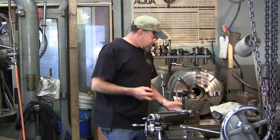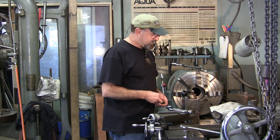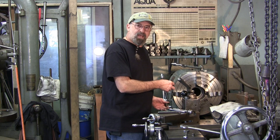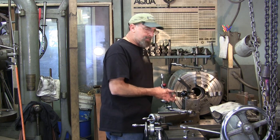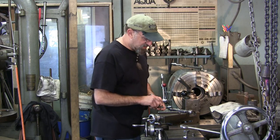Let's pull this gap. We've got to get that in there to prep up the area for brazing, then we'll go braze it, and after it cools down we'll still have the gap out and leave it set up so we can bring it back in and do the finishing machining on it.